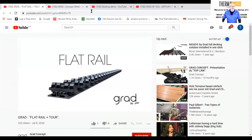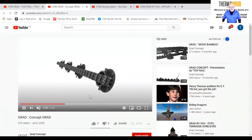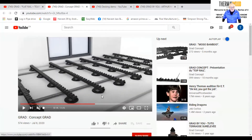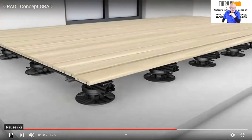The second video uses the pedestal system. The rails are a little bigger, and the pedestals screw into the back side of those rails. You can see all the sections on the rails with the adjustable pedestals underneath. There's a track that goes underneath and snaps into the rail system, holding everything together so there's no tipping in any way, shape, or form. Once that's done, you resume placing the decking boards and snap everything back into place.